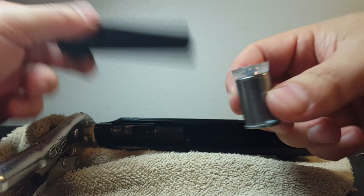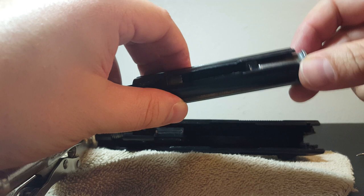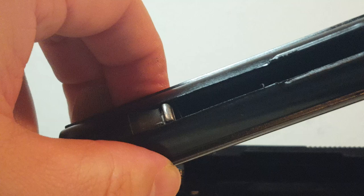We can do it real quick just so you can see what it looks like. It has a rubber top — I would use only silicone on that. There is a catch for your sear catch, and make sure that goes in the slot. You do want to make sure the part that catches on your sear goes in the slot, or you could cause a lot of problems.